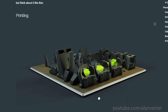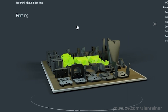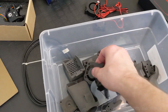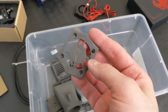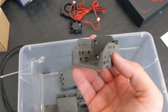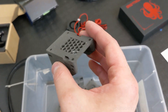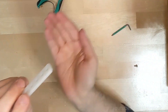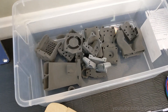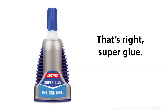Now you can understand why EVA gave me such a hard time. First, I downloaded the default parts provided by RATRIG, which were the captive nut parts. If I had understood EVA before I started, I would have gone to the EVA website and downloaded the version that uses heat set inserts, because I have a drawer full of heat set inserts. Second, when you download all these parts from the RATRIG website, those parts are actually slightly oversized because they assume you're printing on a consumer printer which will print exactly the size of the model but then shrink a little bit. But I decided to print these parts on an industrial printer at the local fab lab — the Fuse One — and the problem with the Fuse One is it already has shrinkage compensation. So when I told it to print oversized parts, it printed oversized parts, and the end result was that all the hex holes were too big and couldn't capture any of the nuts — they just fell out. Under normal circumstances I would just reprint all these parts, but I paid a lot of money for them, so I tried to power through it with a lot of super glue and a lot of swearing.